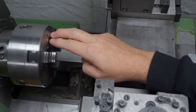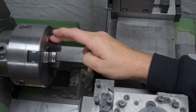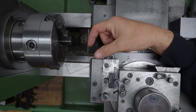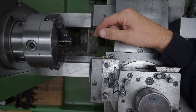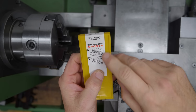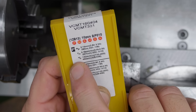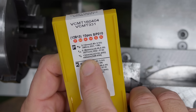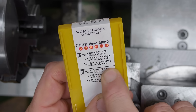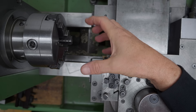If I just use the existing electromechanical brake to stop the motor each time I command the spindle stop, that would work, but it doesn't address this: every combination of stock material and cutting tool has got an optimum surface speed that you want it running over the surface at. It's written on the back of the insert packets. For example, for P - which I think is steel - ideally you want about 150 meters per minute of surface speed, with a range of 100 to 200, and they have the same in feet as well.